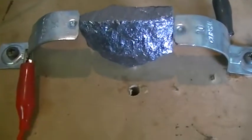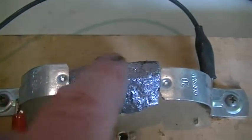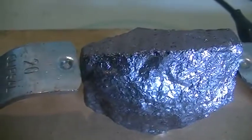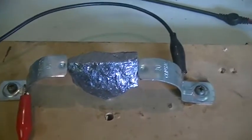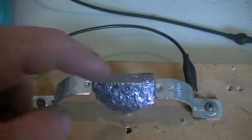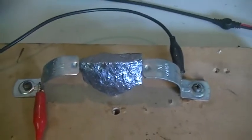Here's another look at our little space rock. I've managed to grind a flat on the top and the two sides with my diamond grinder. This is extremely hard stuff and it was more of a breaking off than a grinding off, but anyway, that's what we have. So 55.9 — nearly 56 ohms resistance across it. All I'm going to do now is use my signal generator and send a square wave signal through it and have a look on the scope at various different places across that flat. Let's see if we can find anything unusual about it.